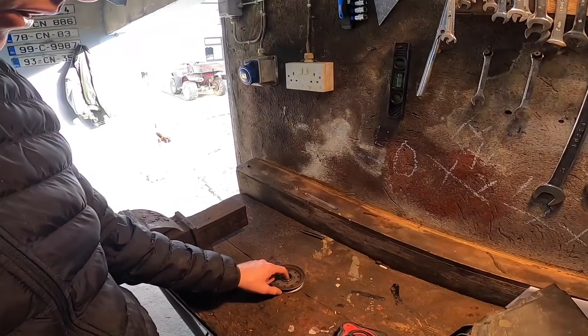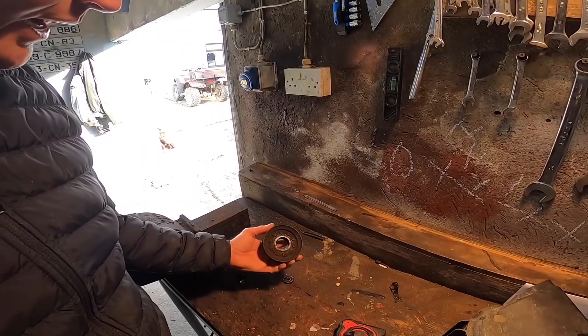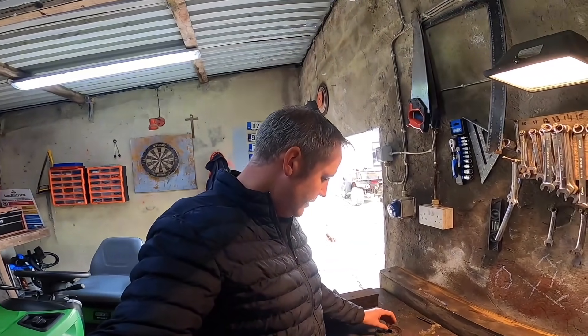It's quite simple to fix — it's just a 10mm bolt holding it on. My brother was very fortunate, he was able to pick one up on his way home from work and just drop it off to me. So I managed to get the deck totally redone with a new belt on it as well. When replacing something like that you're better off putting a new belt on it at the same time.